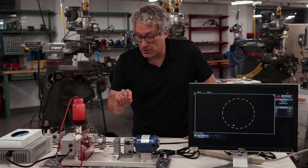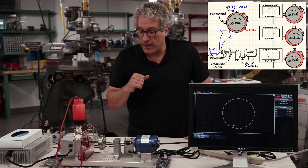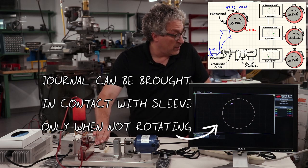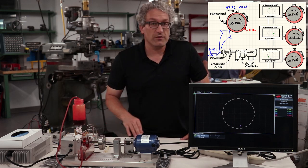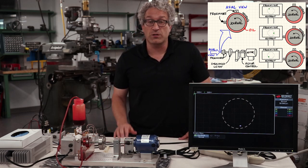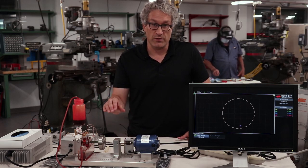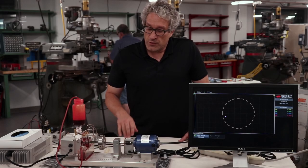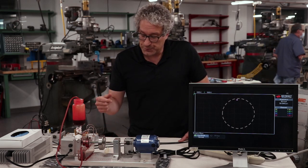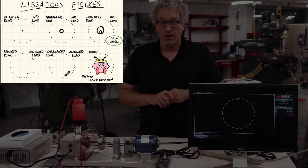The position of this shaft rotating in the housing is detected with these proximeters, and we can delineate approximately what domain this shaft can rotate in. If I apply a force, I can move the proximity readings in a circle. That reads out on my scope and on this screen, telling us approximately where the bearing is making contact with its housing. In operation, if this system is going to avoid wear, it needs to avoid ever reaching that point. This shaft can be actuated in two ways: it's mounted with an asymmetric weight causing a cyclic load, and I can also manually apply a radial load. Let's turn this on.